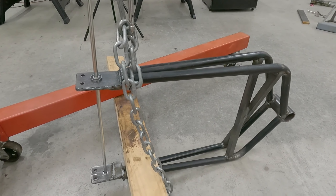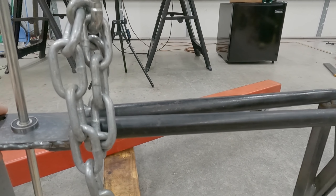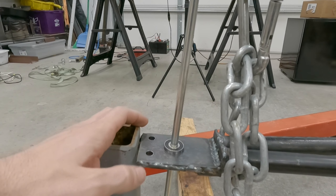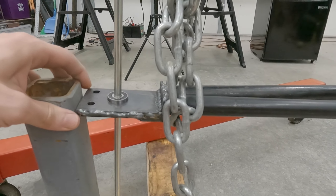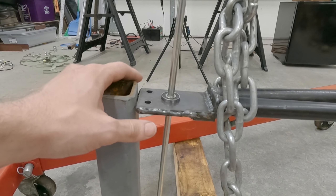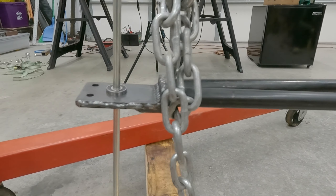I don't have an oxyacetylene torch, and my friend's dad who has one is getting it repaired — it won't be ready till next week. I could wait, but ain't nobody got time for that. What I'm going to do is attempt to bend it backwards. I've got a piece of two-inch square heavy-duty tubing. I'm thinking I can pull this apart, wedge this in, and once it's wedged in at the distance I want, I'll heat one of these legs up really hot, let it cool down, and hopefully when I pull it out it won't spring all the way back.